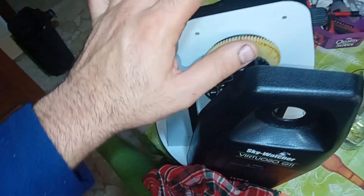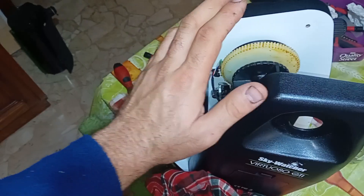Like this you've fixed your backlash issues and you will get much better tracking. I tried this already and the tracking is a lot better. To put it back together, put the screws, the wheel, and everything back — it's the reverse of how I told you to remove it. Nothing special, but now you have fixed your backlash.